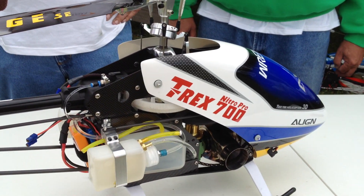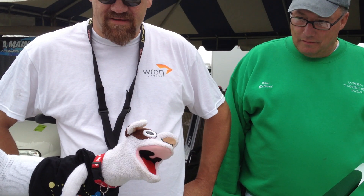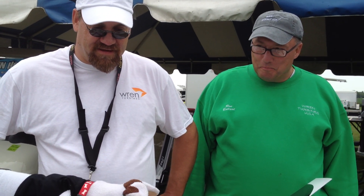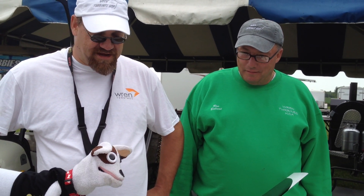I did not see the start process. I played with one of these many years ago and we had to use propane to help get it started — kind of wean it off the propane and give it the fuel. How does this one start? This one is KeroStart. It's similar to how you started off propane, but you have a burner that the fuel kerosene is actually injected into and lights off, and then it runs through the same start-up process over to your main fuel supply.